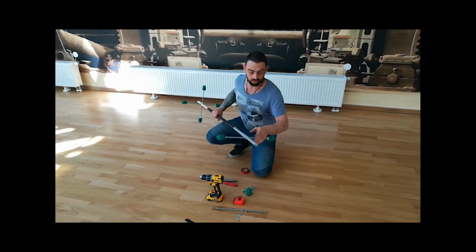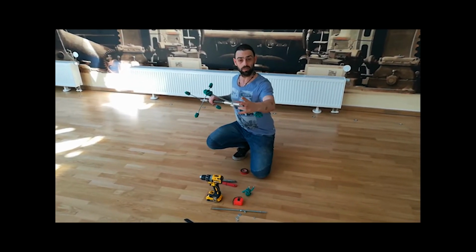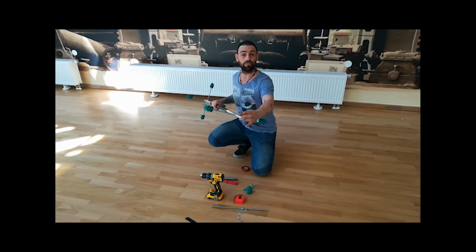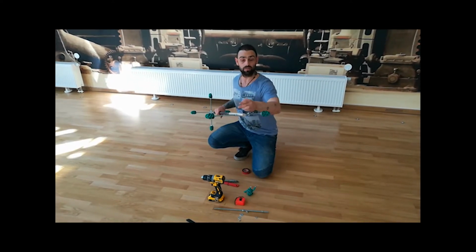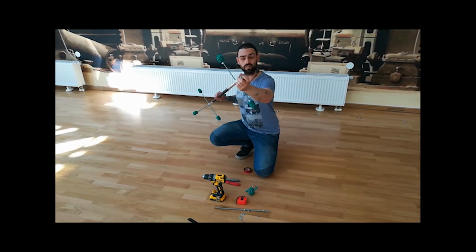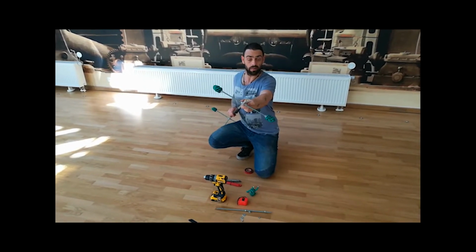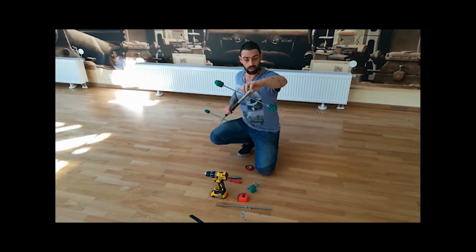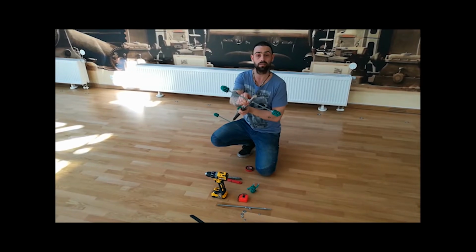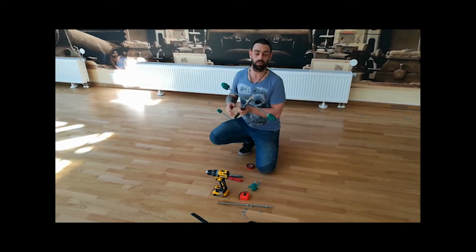First of all, you want dowel. Because I use 100mm flat wick, I go 200mm with the dowel. If you're going to use just 50mm, use 150mm dowel. The dowel is the wood piece that goes in the centre. The reason you need this is that once you start tightening these bolts, it'll close in too much and bend all the metal otherwise. The dowel stops that, especially when you start dropping it. You really need the dowel.